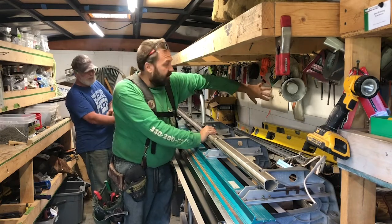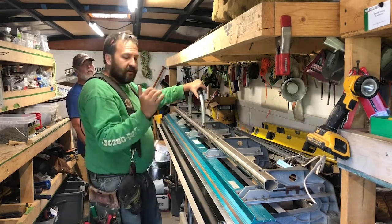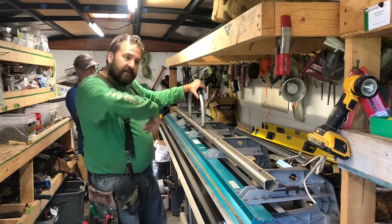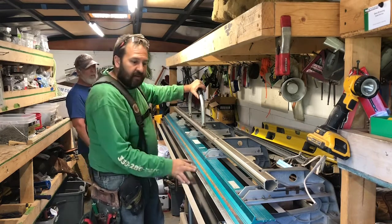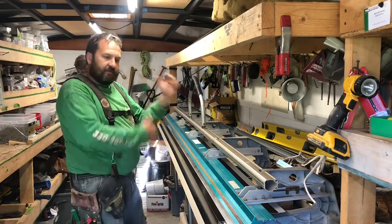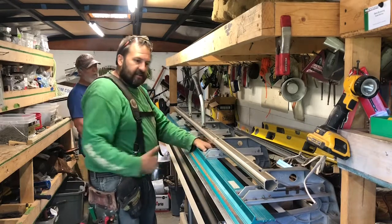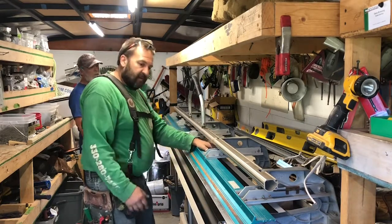We brought our blueprint in here and we put it in front of our face so we have a picture so we can keep track of, is this an inside bend, is this an outside bend, because this gets a little bit confusing when you have to flip the piece around to do insides and outsides and still have room in your brake to make the bends.